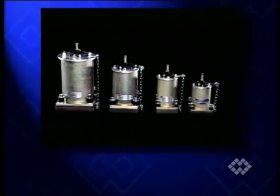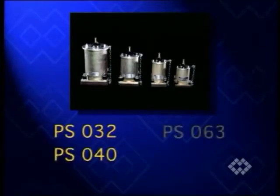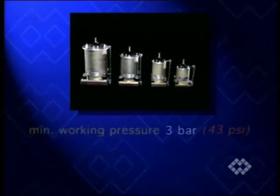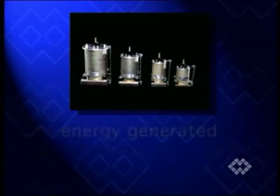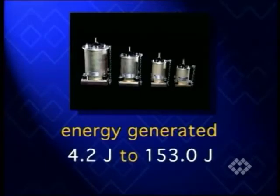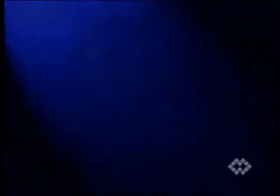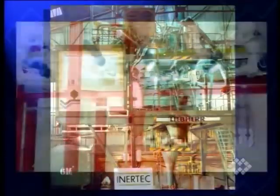Four sizes of PS-type hammers are available. The minimum working air pressure is 3 bar, maximum is 6 bar. Depending on the model, PS hammers generate energy ranging from 4.2 to 153 joule. When choosing the installation of a hammer, you should bear in mind that the repetitive mechanical impact could lead to fatigue damages of adjoining parts or equipment.